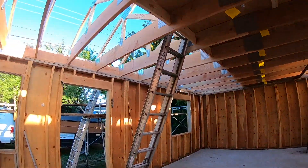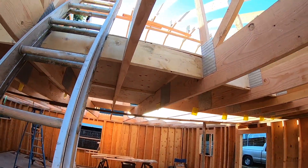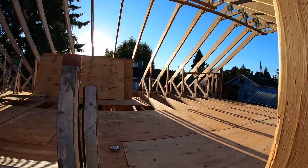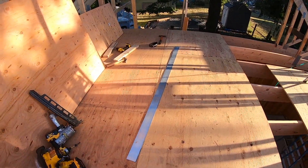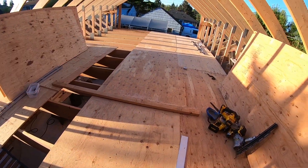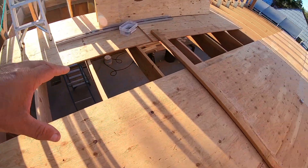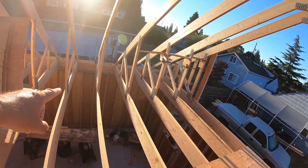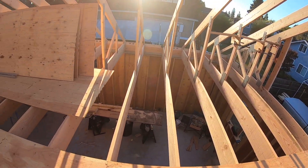Let's just climb up the stairs here and take a look at what's up there. You can see this floor is well underway — this is the top floor. We have our first couple of rows here laid out and they are fastened. We are going to go ahead and put our butt blocks in for this next row. When Charles gets out here, he'll start putting in all the butt blocks. We'll put down another row and do our blocking along that side, which holds us exactly at 24 inches on center, and we're going to finish sheeting this floor.